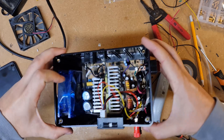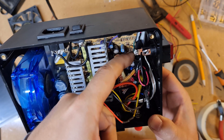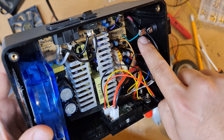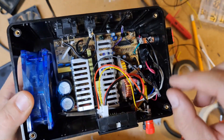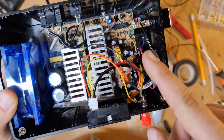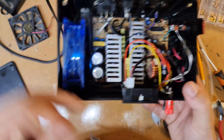So as we approach the witching hour this evening, we now have the power supply mounted in the box. The green to earth wire I've put through the switch, so we can turn the output on and off, and we can turn the input on and off as well. The power resistor is tucked up there in some tape for now, just to see if this works between the 5 volt and the ground. Based on what I can find from the eBay listing, I think the wires are in the right place for power and sensing.